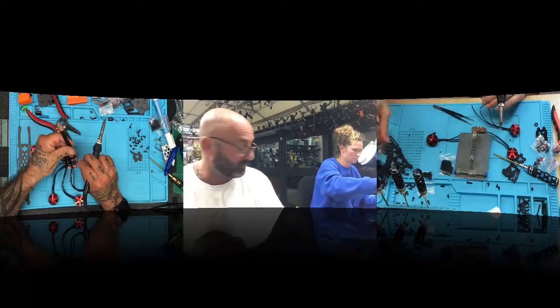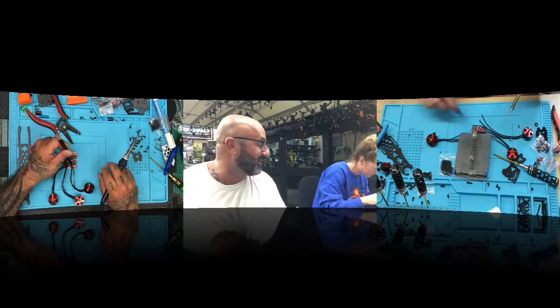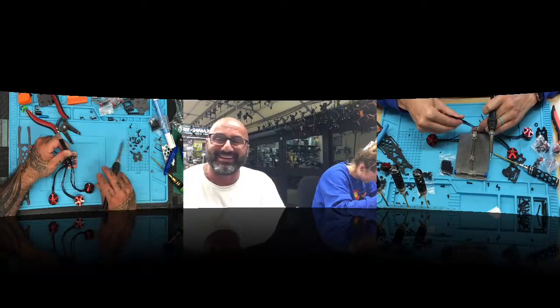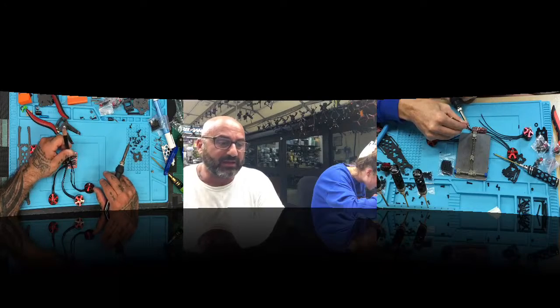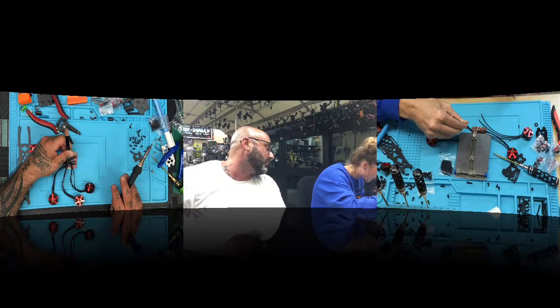All right. How's it going? It's going better now? It's okay. So you put the board under the plate that's supposed to hold it in place. Correct. That's the best way. See, look, he just did the same thing. Don't pull the wire away so fast. Let it cool on the solder first, okay? Keep it on there and wait for it to cool, and then let go. There you go.